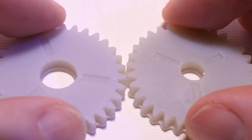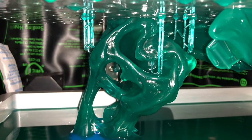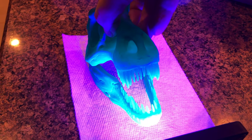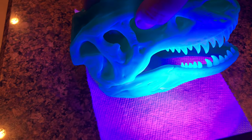You could reduce the elephant's foot by reducing the bottom layer exposure time or by reducing the number of bottom layers, but I don't like this idea. A thicker elephant's foot means better adhesion to the build plate, and reducing either the time or the number of layers too much will reduce adhesion and could lead to a print failure. So in my opinion, it's better to use one of my methods because they don't require you to reduce the bottom layer exposure time or the number of bottom layers. If there were no impact on the physical appearance of your printed part, it might even make sense to increase one or both of those values.